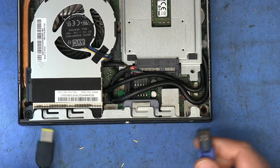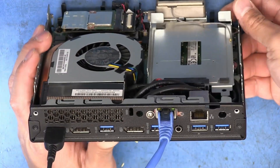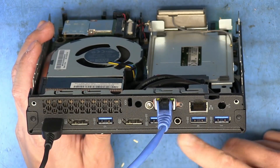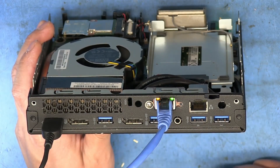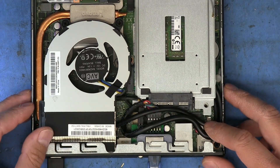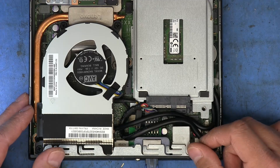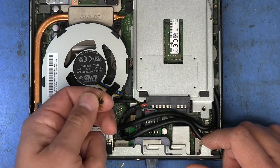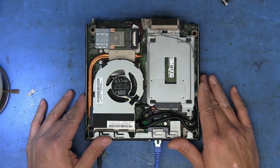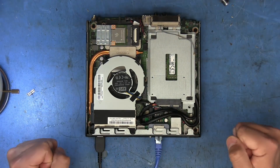Let's power it up and make sure we can actually get it to connect. I'm not going to bother trying to show this in Windows or anything again — I'm just going to see if plugging in an Ethernet line gets these to start blinking. So here we go, got a power supply, and we'll plug this in. It's going to do a blink and then turn off as it's acquiring an IP, and then after that it should turn on and stay on steadily. There it goes — turns off and it should come back on. There we go, starts blinking. So this works and it's another option, and it's definitely a lot faster than what I did. That was pretty much the sole purpose of this video — just to investigate if this was a potential option for using one of these cards. It just requires getting some of these right-angle pin headers. You just got to do a little bit of work to both of those boards and you're good. So yeah, that's going to do it for this one — it was just a quick little investigation. I hope this information can help somebody out there. Thank you for watching and I will see you guys around the bench.